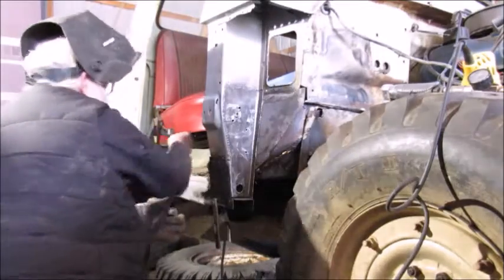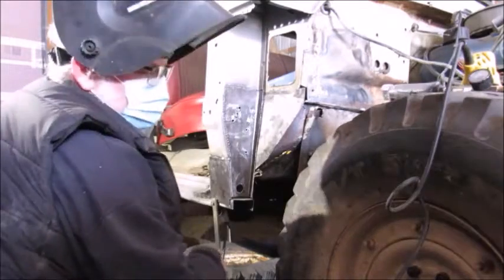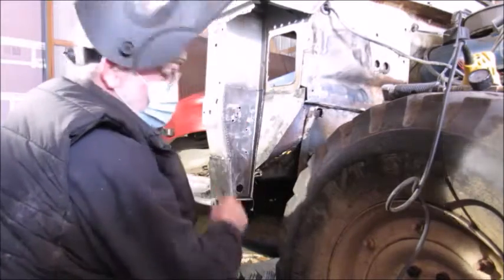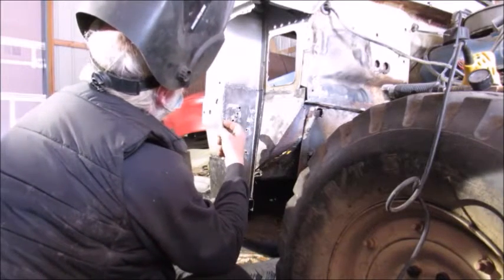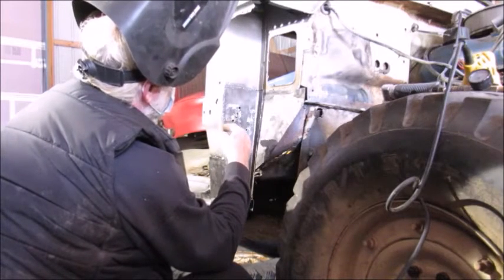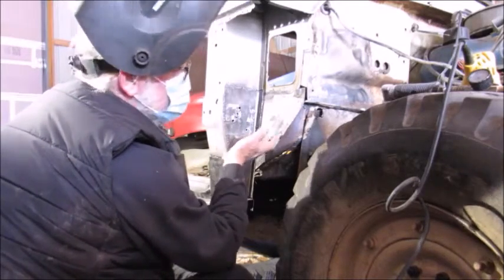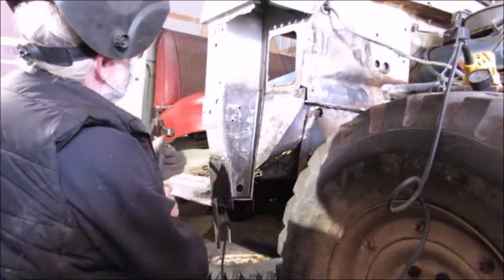You know, here's what it is. The end goal is to make sure that your seam is completely welded with no pinholes in it. If you got pinholes, you're going to get water and moisture in there eventually. You got a pinhole here, you get some moisture and water on it, it's going to start eating that out. It's going to continue and continue, and that's what happens with this here, it probably started with a small spot and it gets bigger, and then as it gets bigger you get more stuff in there, which makes it even bigger, and on and on and on.